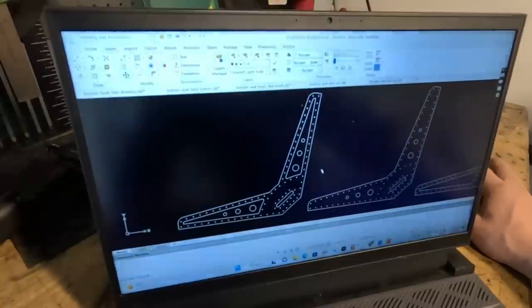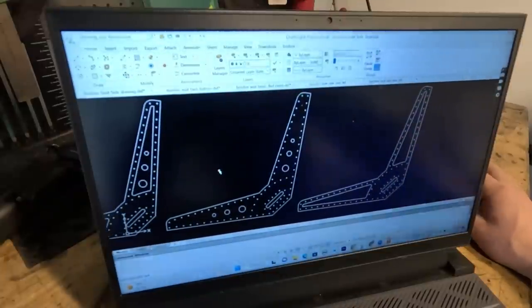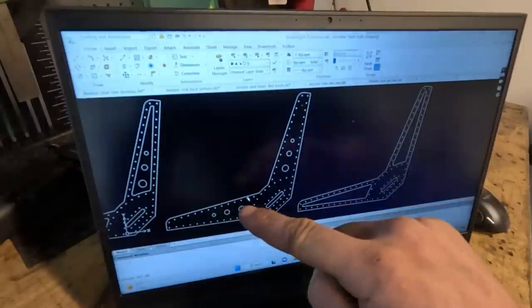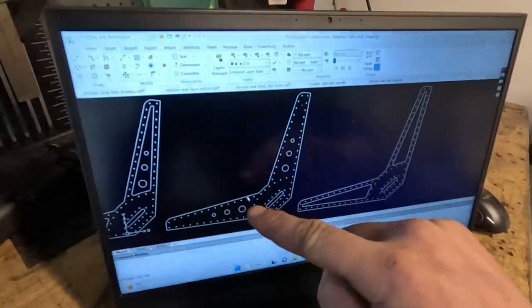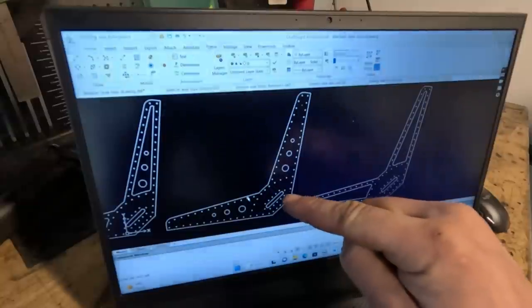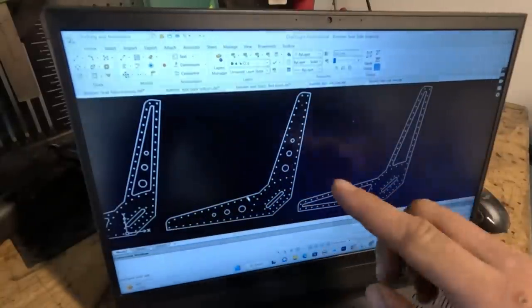This is actually two layers. So as I look to the right, these are the layers separated. So we've got this as our bottom layer. We're gonna dimple die these three holes. It's a 1/2 inch, 3/4, and 1 inch hole. And we'll dimple die those. We've got the seat belt slot. We've got all these holes pre-put in here for the rivets.